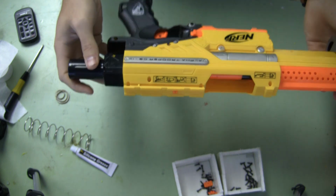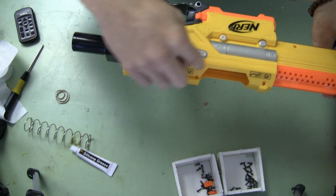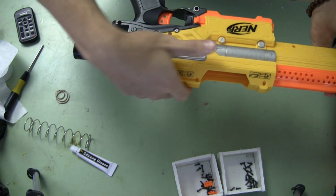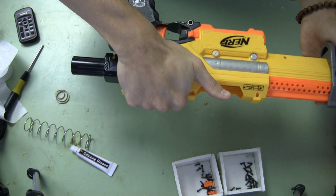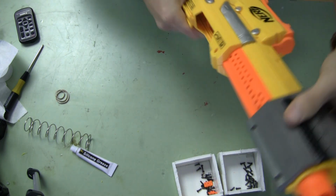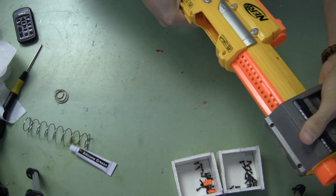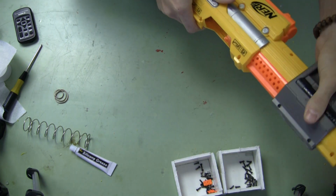And to test the prime, because the bolt sled has the tendency to warp, either screw it together in this area or squeeze really hard right there to simulate having the screws in. Then take the back cap and place it on the table or against yourself or whatever. Apply pressure to keep the bolt sled in place and test it out.